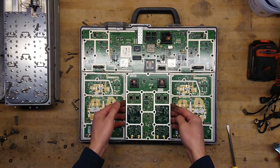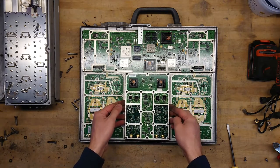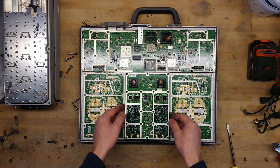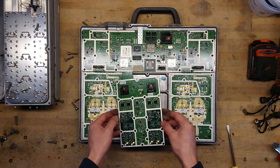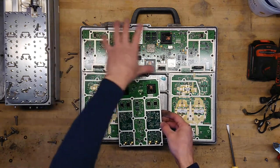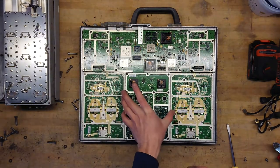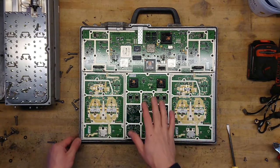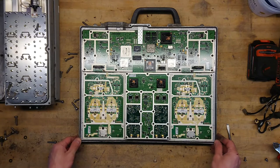This is a receive filter — filtering and analog-to-digital conversion — which connects through this multi-pin connector down to the main control. Very nice layout. It will be easy to show the signal path on these because it is a generally simple layout for a 3G amplifier.